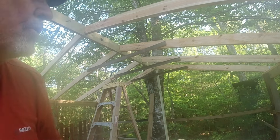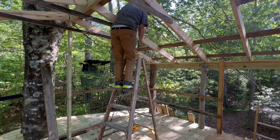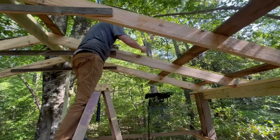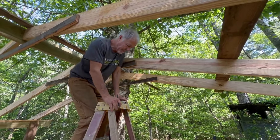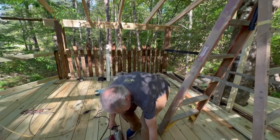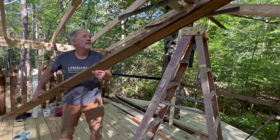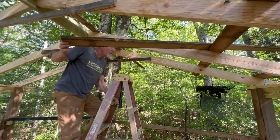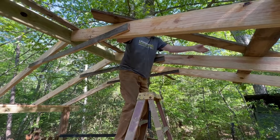Three down, two to go. Stripping the roof — I started with one on the outside edge, then put one directly over the beam, then one up top for the ridge cap. Then I measured the distance left and divided it into thirds and put two more strips. Doesn't really matter how far apart they go — somewhere between two and three feet. If you get them much more than three feet and you stand on the tin in the wrong spot, you can kink it. So these are mostly 24 to 30 inches apart.